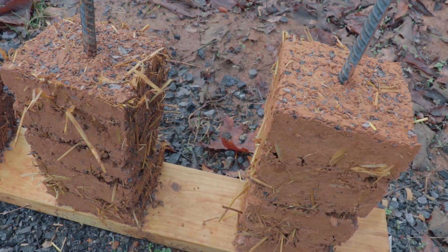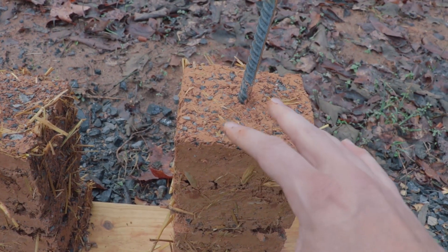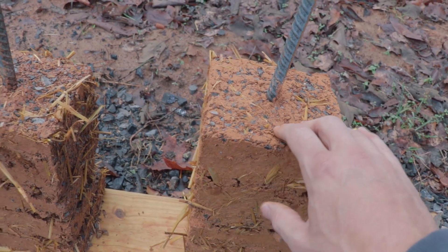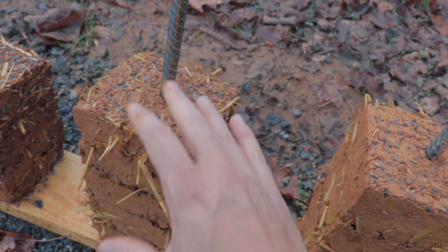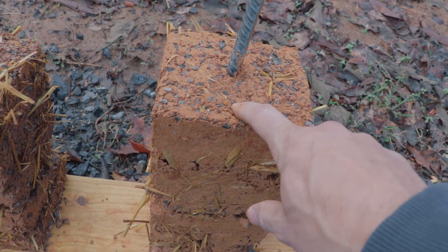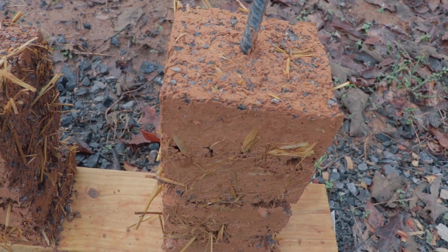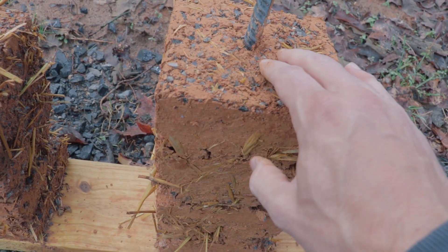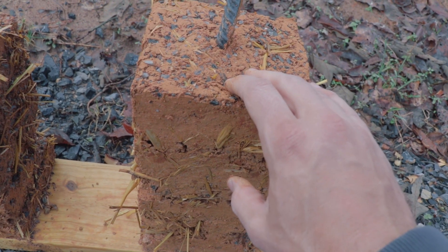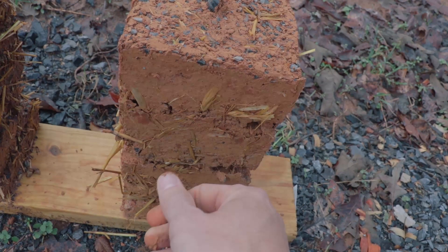I could do some further tests — do a 10% lime versus the 10% mix which here is made up of 5% lime and 5% pozzolan, to see whether the 5 and 5 mix is better or just as good as 10% lime. The 10% is definitely better, so it's obvious that the more stabilization you add, the better. We just don't want to go too high with the stabilization because we could potentially lose some benefits of the cob, such as vapor permeability of the wall. So I'm trying not to go above 10%, and honestly I don't see why you would probably ever need to.